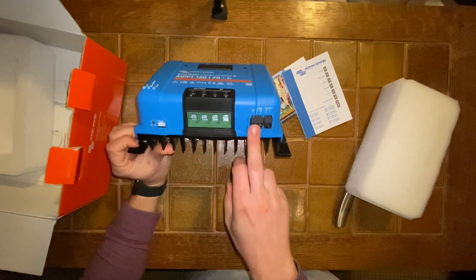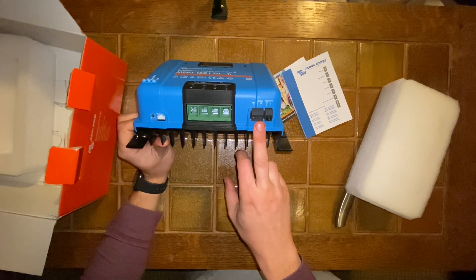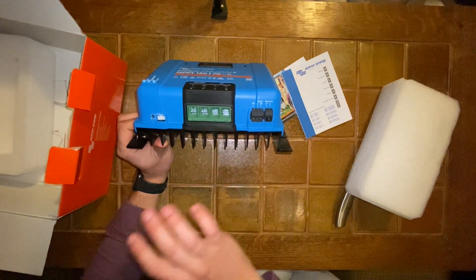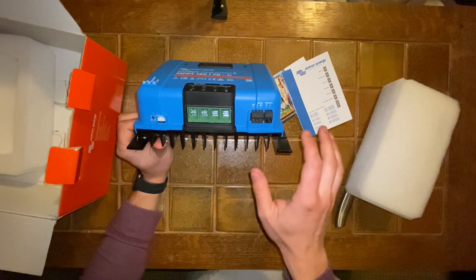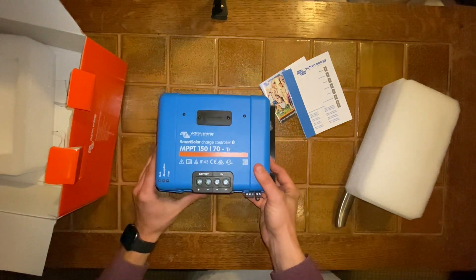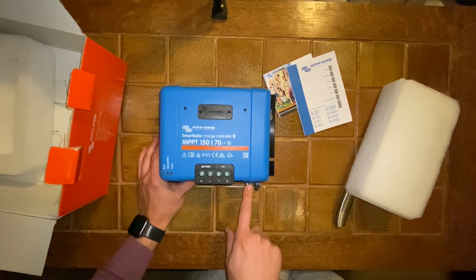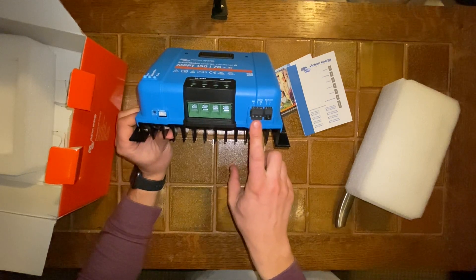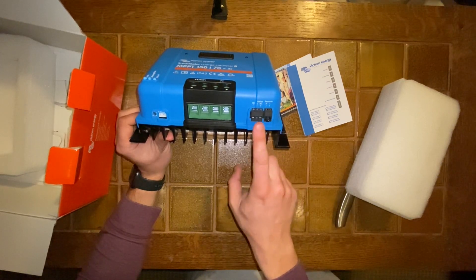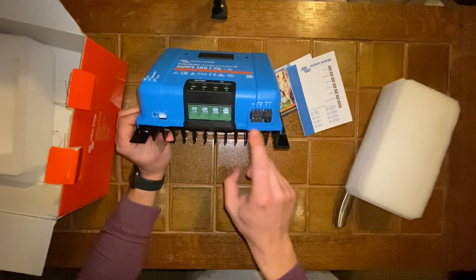What's also really neat is that you can set up this relay. I have an inverter that should shut down automatically at whatever preset voltage I set, which is really handy so it won't over-discharge the batteries — I can set it at exactly 48 volts via the inverter. I'm also going to have a BMS on my battery, so the BMS should also shut things down if they get too low. But I could also have a third redundancy: I could set up a relay on this to control total access to the battery, disconnecting other sources if needed.